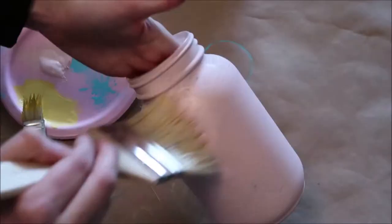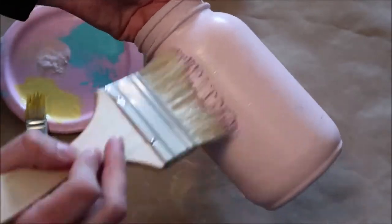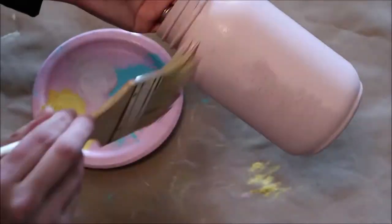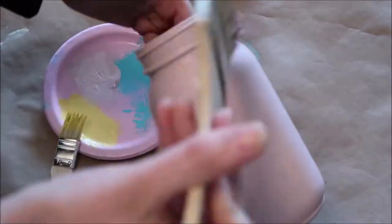When I was doing my second coat, I noticed that my brush would sometimes take off a little bit of the first coat of paint. If that happens, just dab some paint onto that spot instead of brushing over it, and then later when it has dried a little bit, just go back over it and do a brush stroke over it.